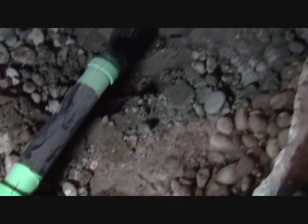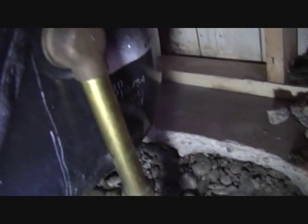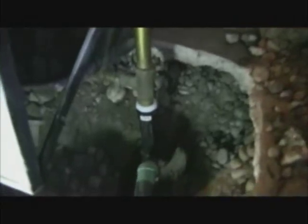Make a mark on the cement floor from the Y fitting to where the floor drain hole will be located. Break the concrete along the mark and remove dirt to allow for the drain pipe connections. You will need to dig deeper for the P-trap.